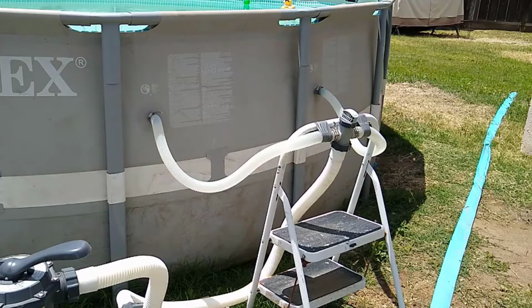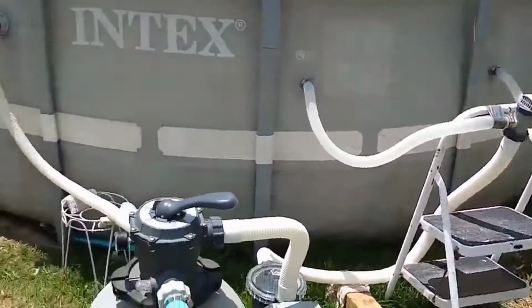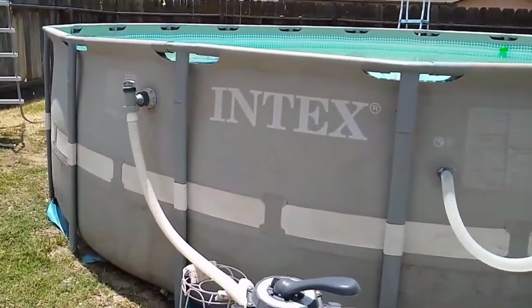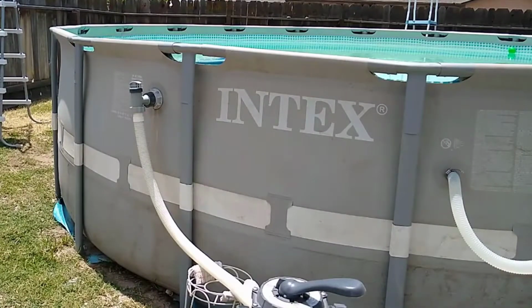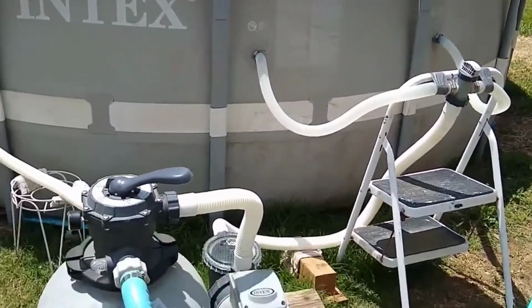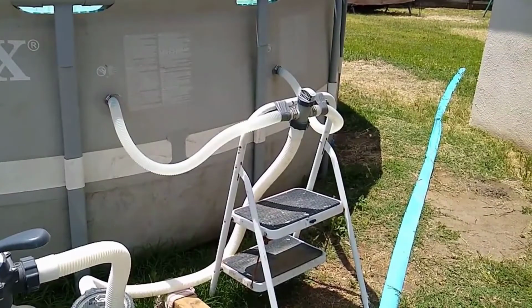So after that, the result was all pool makers switched to a dual inlet. So a dual inlet on the inside of the pool, each inlet's going to be half the suction of a single. But being that they're coming into one and to a T and then back into the inch-and-a-quarter pipe, the water flow going into the pump and back into the pool is going to be the same. I have not noticed any difference. So less suction from each one, same water flow. More parts to replace. Excuse me.